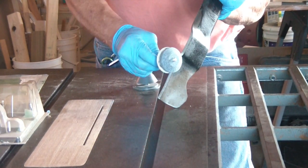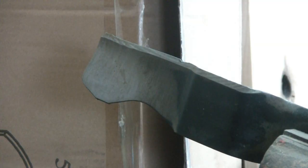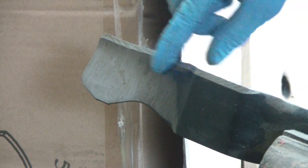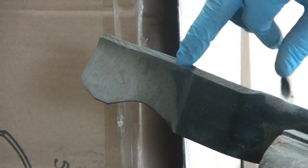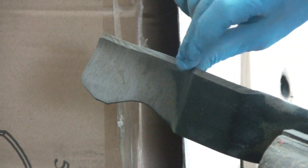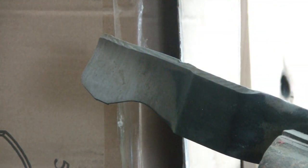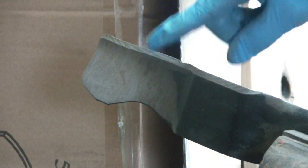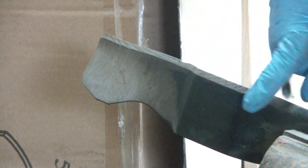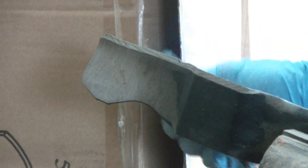I'm going to use this tool for this part right here to keep the pitch good. I'm going to do the damaged side first. I'll keep running my sharpener stone back and forth until I get this area looking pretty good, then put it on the balancer, and start doing the other side until it evens out. Once it evens out I'll get my hand file and file the edge right here — this dip — as best I can to get an edge back on it.